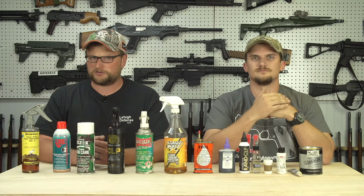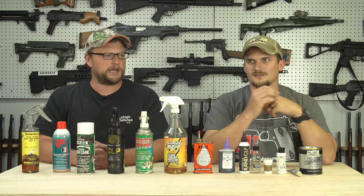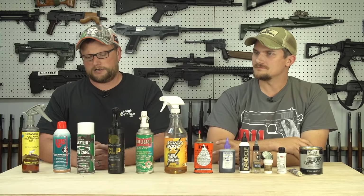You know, we are in the southeast here. It's a very humid environment. There's a lot of high moisture in the air, which can really lend itself to flash rusting in an absolute hurry. Georgia summers are brutal, boy. Yes, very humid here. And plus, your body chemistry can have a lot to do with how much rust can develop on a given gun.